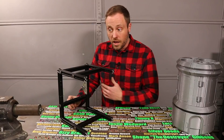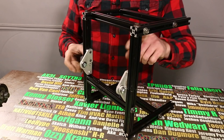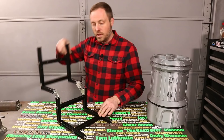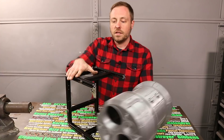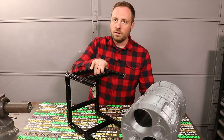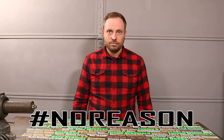These black pieces are aluminum rails from a junk 3D printer that I had. I couldn't ever get it to work, so I decided to repurpose it and turn it into the center section of the frame for the launcher. These hinges I custom made from thick aluminum plate — they ride on ball bearings and are very accurate, so this thing opens and closes very well. But as it sits, it doesn't have the rollers for this section to spin inside, the frame isn't terribly stiff, and it needs a locking system to stay closed — which is difficult because nothing touches on the front side. That means the lock-up mechanism has to be at the back, and the disengagement at the front. I'm going to get the rollers on first, but I think I have a good idea for the locking system.